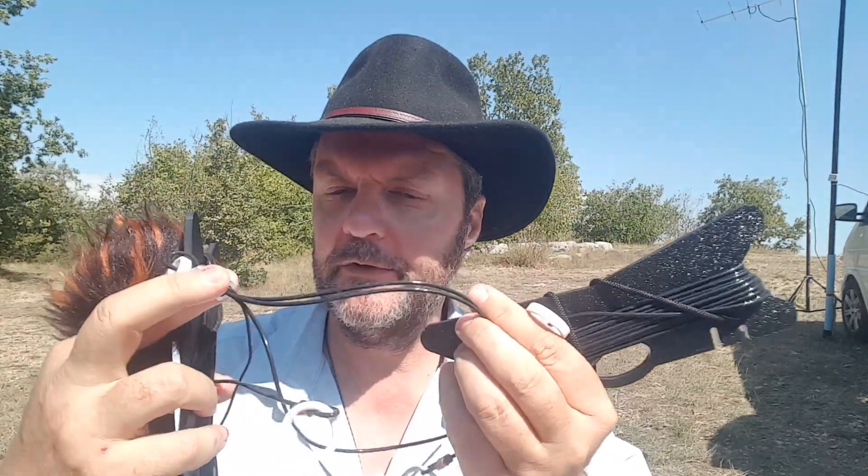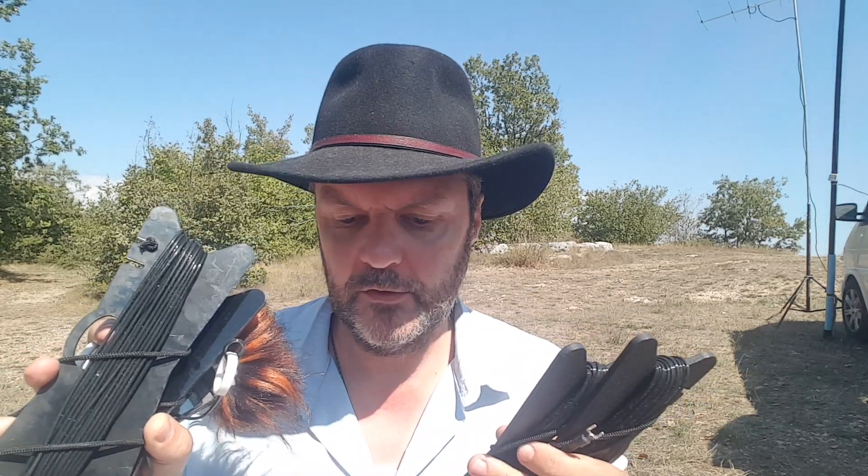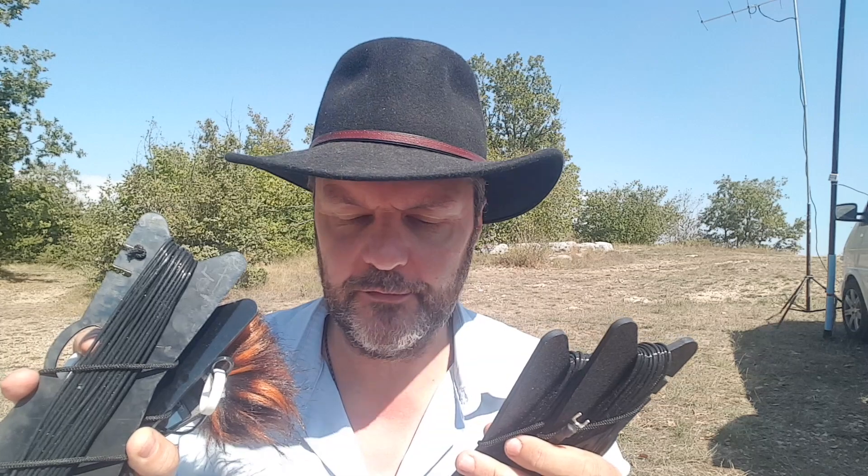They're connected in the center. There are rings for stress relief; the wires are clamped — very good quality wire, as usual for Chameleon. There's a connector here which connects to the balun. Of course we have two pairs total, so I'm going to deploy the dipole in a cross pattern, which will also help stay the mast like guy wires. I'm going to use my adapter that I 3D-printed for this task, for the spider beam 12-meter mast.